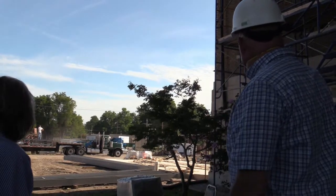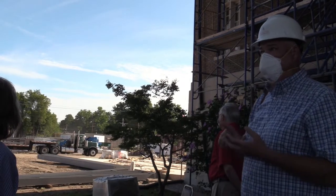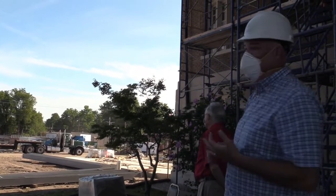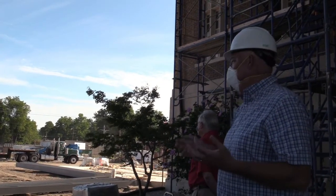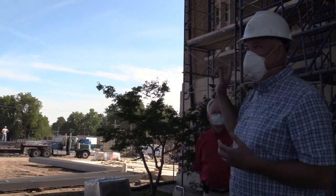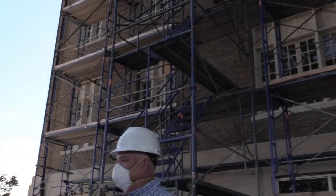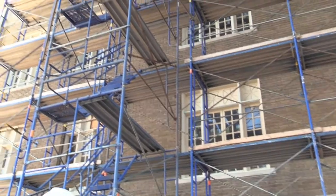the existing building. And what they're focused on right now on the existing building are the windows, the brick repair, limestone repair. Renaissance Roofing, the other contractor, already finished the roof. So you can't really see it, other than the drone footage, which you might have seen, the new clay tile roof, and the new copper gutters and downspouts. They're holding off on the downspouts. These are just temporary corrugated plastic downspouts to preserve the copper ones from getting damaged.